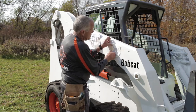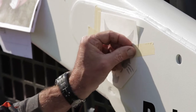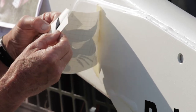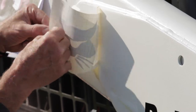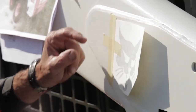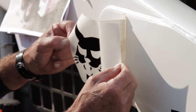So instead of putting a hinge in the middle, it's a small decal, we're just going to put a single hinge off to the left. Pull that tape tab off very carefully so we don't lose any whiskers. If you were in close, you'd probably be able to see I'm fighting with one of these whiskers. If that happens, just re-squeegee the decal. A lot of times that'll take care of it. Just squeegee the whole thing one last time. Yeah, now those whiskers come up nicely.